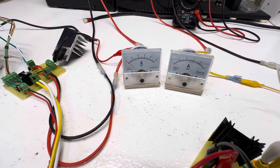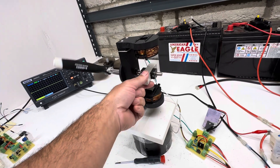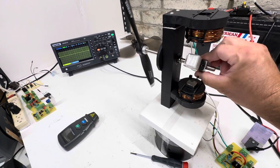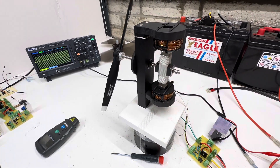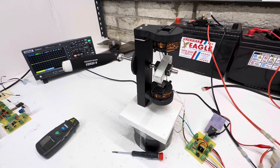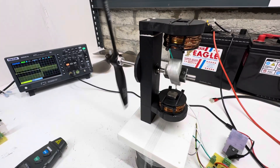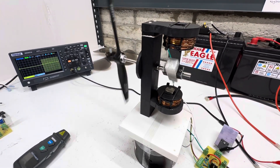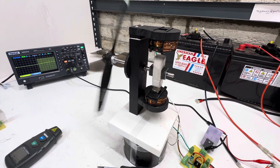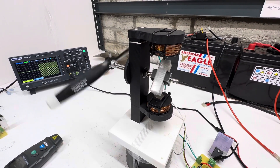At 9%, you can't even really recognize it on this amp meter. If you look at the scope, you can hear it — this is the power on. It's not really enough to push it away, but it's enough to where it has a little bit less magnetic field. If we get it in the neutral position and we let the magnet pull itself in, it can actually start itself. So it's actually using more of the magnet than the electricity at this moment. The coil can't push it away, but it makes the magnetic effect a little bit lower, and then the magnet attracts to the steel and starts running. Pretty neat that it could run at this low of energy.